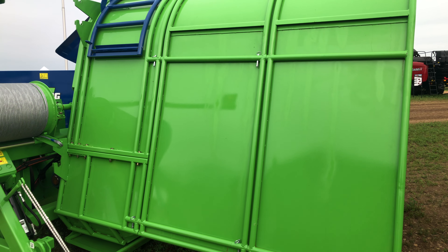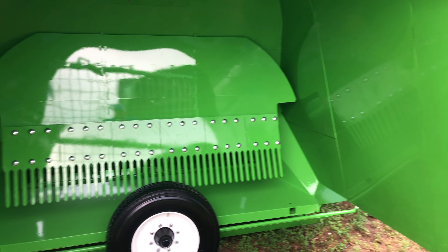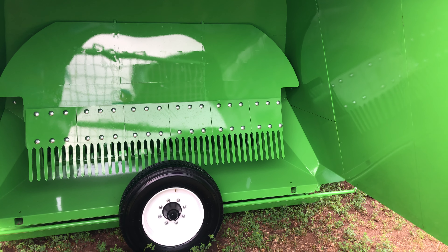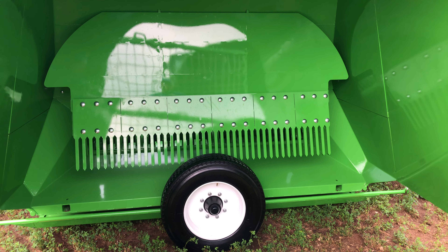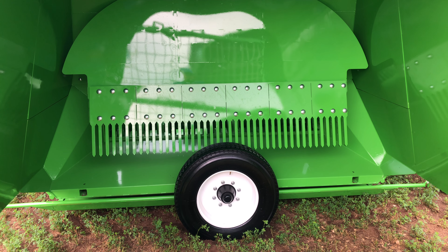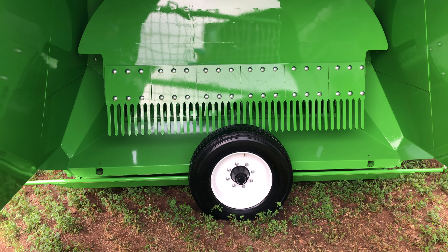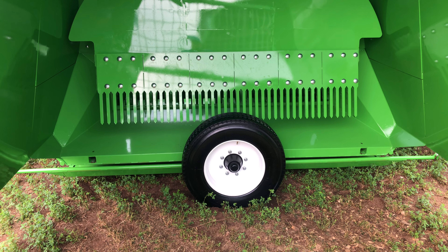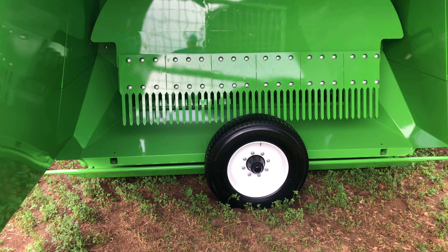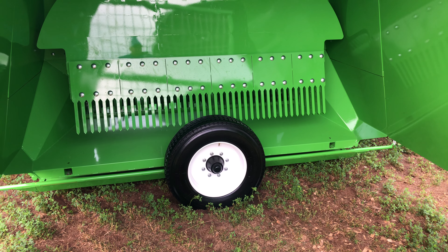The tunnel design has also changed in several ways. The profile has slightly changed to allow for better packing and more density, with a slightly narrower top and tilted sides to allow for stacking of the tunnels. We have also incorporated a tunnel clean-out system to allow for ease of switching over to a new bag or cleanup at the end of a bag — all hydraulically operated. The operator simply pulls the hydraulic lever, starts the PTO while in the cab with the machine in neutral, and then slightly pulls the machine ahead while the clean-out pushes all material off the pan into the bag. This eliminates feed lost at the end of the bag, saves approximately five feet of bag plastic per bag, reduces cleanup and reinstallation time, and provides a cleaner finish to prevent any waste of forage. When finishing a bag, there should be no pitching needed before installing the next bag.